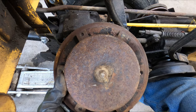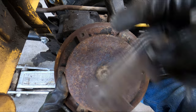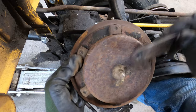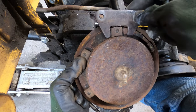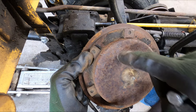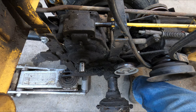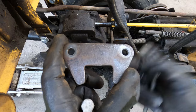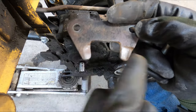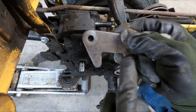For people not familiar with these, your best bet is to shut the tractor off to switch from high to low. Going from low to high is simpler because you're just disengaging — moving the plate down. When you're in low gear you'll be cradling one of those dogs or sitting in between. When you put it back into high, the piece moves in toward the tractor giving you the gap. People get anxious and slam it in — this is the original plate and one side has been whacked quite a few times. I'm going to flip it and use the other side.